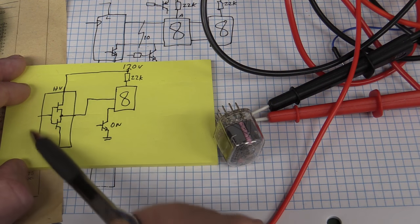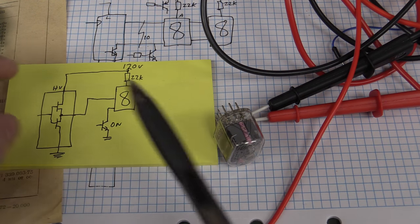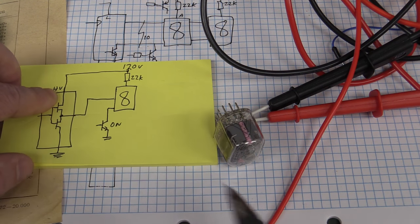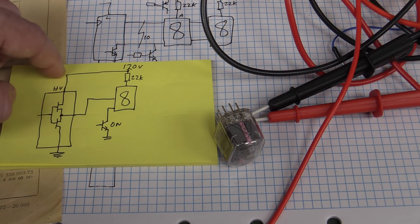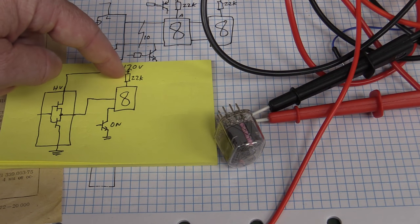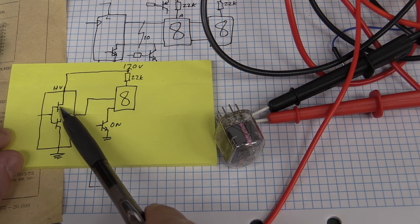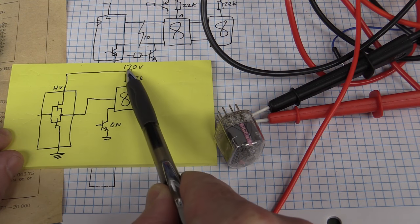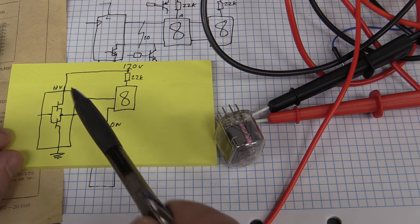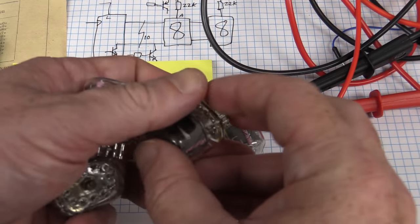Now, if we're driving it with one of these Microchip drivers that has a totem pole output, it's got an HV pin on it, a high voltage active pin like that. So surely you would take that up to your 170 volt supply. That's naturally where you'd put it. But will that cause a problem, with the output transistors shorting all these other pins back up to the 170 volt supply? I think we might come a gutser. So I won't experiment with my good Nixie tubes.